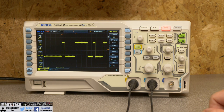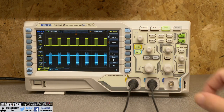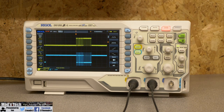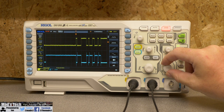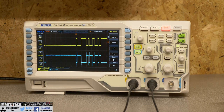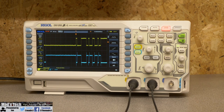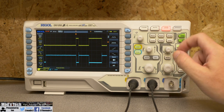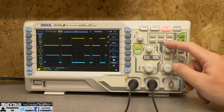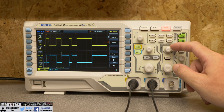Clipping the probe onto the other output lets us take a look at how it looks on a Futaba system. With the second probe on, we have two channels: the top one is FR Sky and the bottom represents standard SBUS from Futaba. Zooming in and stopping the scope, the big difference is the voltage level. The FR Sky signal goes from ground to plus 3.3 volt to register as one, whereas the Futaba-style signal starts at high and gets pulled down to ground to represent one. That is the difference between the systems.